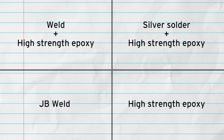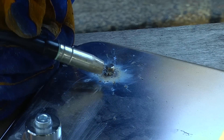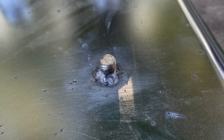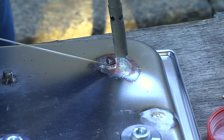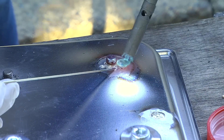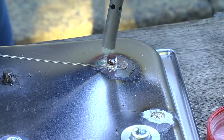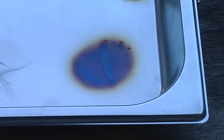I plan to try and tear each of these off while measuring the level of force it took. I mentioned I had the wrong sort of welding equipment, but I had a go anyway — just using some small tacks, but I still managed to blow a hole in the thin stainless steel. Thankfully I was able to weld a patch, and all in all I was reasonably happy with the end result. I also tried silver soldering, which seemed to work quite well. The tank bulged quite a bit from the heat, making it hard to keep the bolt flat, but I think that's something I'd get better at with practice. Thankfully the bulge flattened back to its original shape after cooling, and a dark mark on the stainless steel came off with just a light sand.